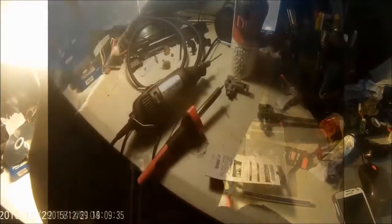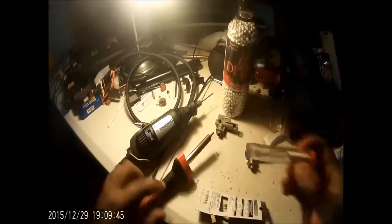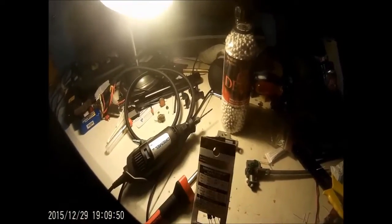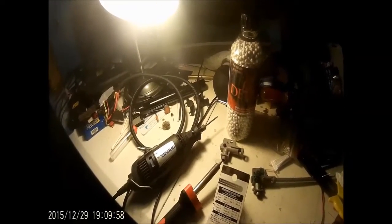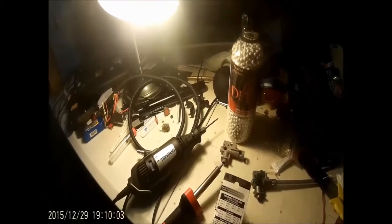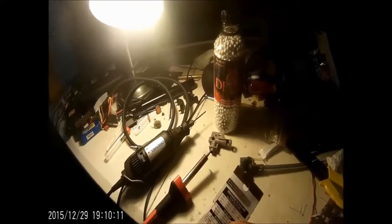They are ridiculously small. Other materials you're gonna need: a Dremel with a 3mm drill bit, a soldering iron, some solder, and resistors. Go for the 150 to 200 ohm resistors. If your resistors are too high, not enough power is gonna get to the LEDs and they'll look dim. If the ohms is too low, too much power will go to them and it will burn out the LEDs. I've actually burnt out about 10 of them experimenting with the numbers, so I settled on 150 to 200 ohms.